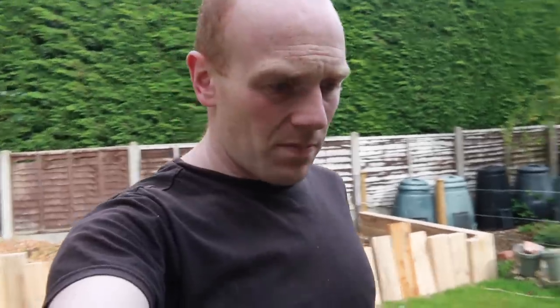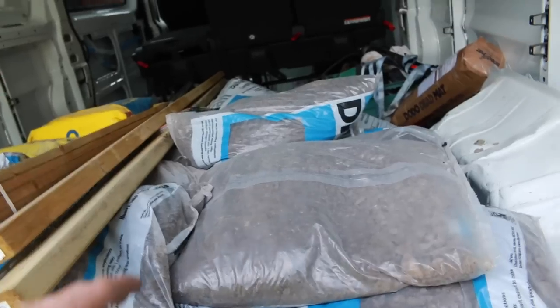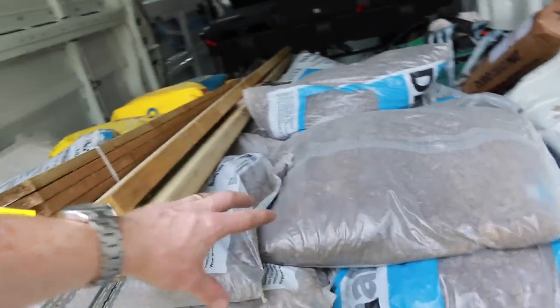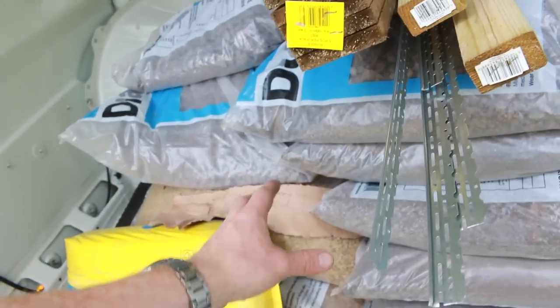Okay, we've just arrived back up here in Cheltenham and I've just been and picked up a whole load of materials ready for the job in hand. So I've just gone for an all-in ballast, pre-mix, sand and gravel for our concrete mix, cement over there, and a load of just 10 or 20 mil gravel for drainage.